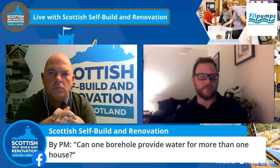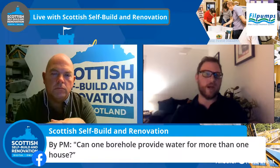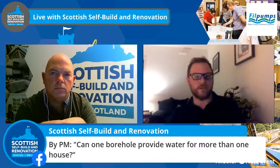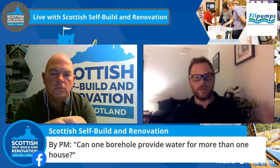Particularly with new builds, water usage is going up and up and up, even if it's purely because the utilities we're installing now, like washing machines and showers, are drawing more water than in an older house. You could have a new build 4-bed house compared to a 4-bed house built 20, 30 years ago. On paper they might have one bath, one shower, one kitchen sink, utility sink, but the newer house will actually have a higher water demand just because of the appliances.